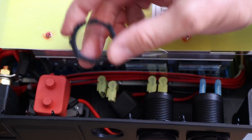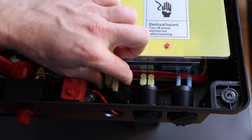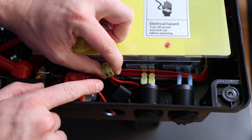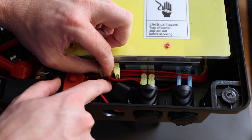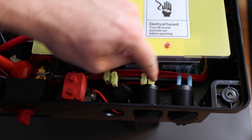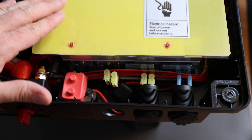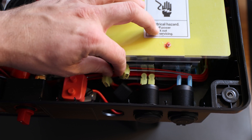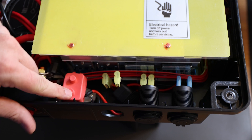Take the little ring out and pull it out from the front. There's one thing to pay attention to as well: the negative and positive wires appear to be going in series. So it connects here, then connects over here, then comes to the last one — they're all connected in series. If I said that incorrectly, please correct me. They use the same wire coming from the positive — a little bus bar.